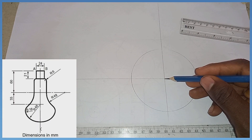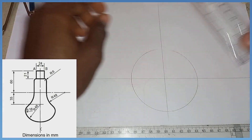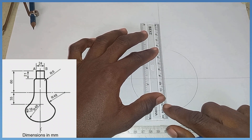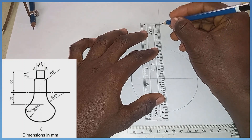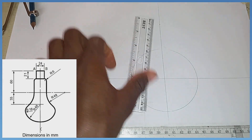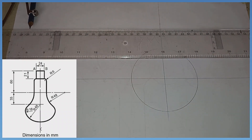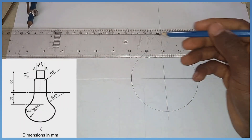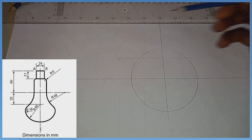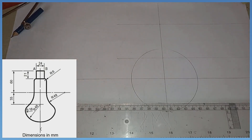From the center of the circle, with radius 40, I'm marking 33 and 60 — that is a mark of 93. Picking my ruler along the vertical line, I'm measuring a mark of 93 upwards, then picking the mark of 60 as you can see on the screen. I'm going to project each of these marks horizontally in this manner.